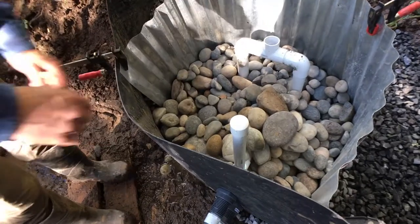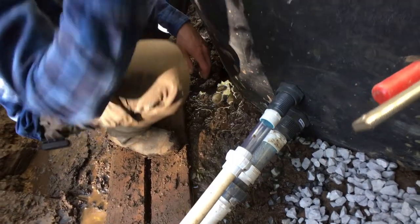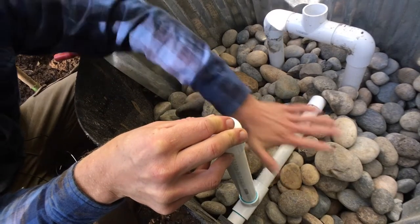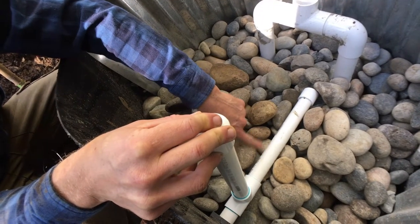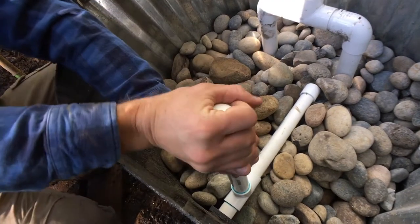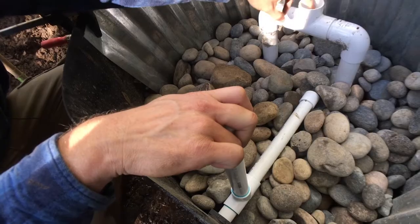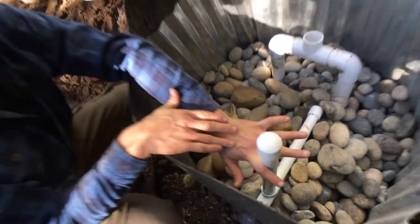Last shot before we cover it up: this is the overflow pipe — a one-inch line coming out of the wall, set about three inches above the top of the main collection pipe. We've added the collection piping for the overflow inside; it extends back about twelve inches, perforated with holes drilled on either side. If there's a high flow event and the spring goes crazy, we want the water taken out by this pipe so it doesn't pile up behind the wall and increase weight on the system. The cap here is removable — this is a shock port — so if there's ever a contamination event you can dump bleach in here to disinfect the spring collection point. There'll be the same thing for the main collection piping: a little riser with a removable cap. These will be the only things visible above grade once it's all covered up.